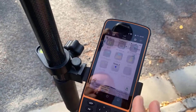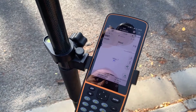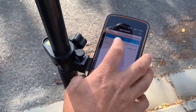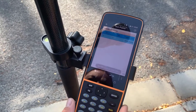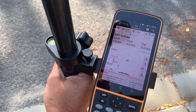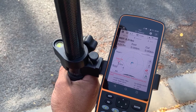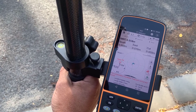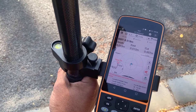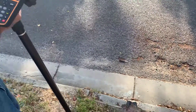Now I'll go to Points Stake Out and call up that point. That just shows us we are on the point — every indicator here is the program telling us we're within five centimeters of the point, which is actually a three centimeter calibration setting. You can see the accuracy is pretty good.